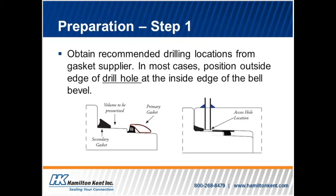See the images on the slide for a visual representation of where the access hole is meant to be between the primary and secondary gaskets. It is imperative that the exhaust port be located at the highest vertical point to allow the full and complete release of all entrapped air. Consequently, it is recommended that testing be performed with test pieces and sections installed horizontally. Typically, the exhaust port is connected to a one-eighth to three-eighths of an inch NPT-F threaded T, with one side of the T going to a shutoff ball valve and the other side going to a pressure gauge, zero to 30 PSIG. The inlet hole placement is optional, but if the pressure gauge is to be connected to this point in lieu of the outlet hole, then in accordance with established practices, it should be located no lower than the horizontal centerline of the joint.